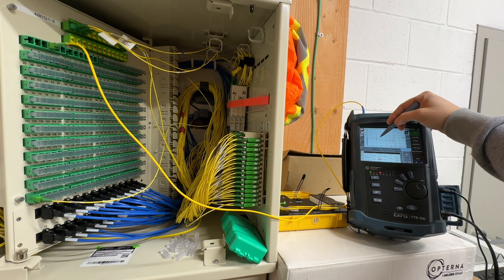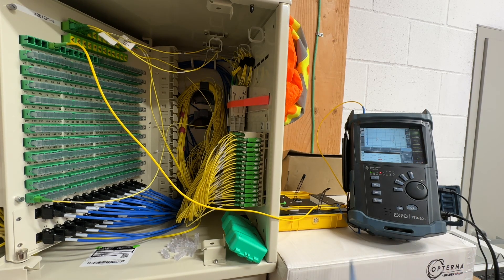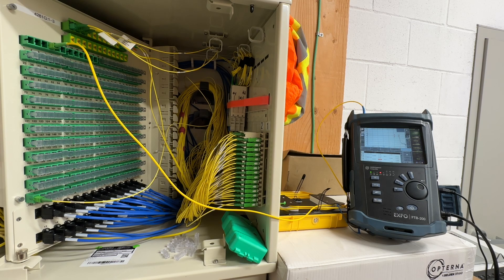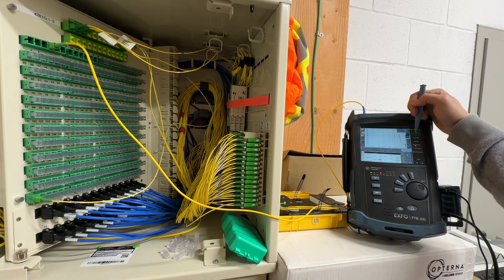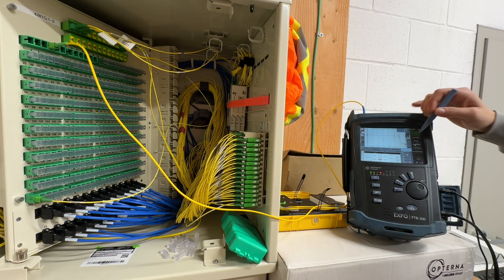Right here we've got a connector, a little bit of reflectance, very small amount, and a connector loss of 0.58 dB — which is a little bit high. It's passable, but we'll give it a clean and try to get it down. After cleaning and retesting multiple times, there's no change in the connector loss. We'll add a comment stating that — it'll either have to be looked into by the manufacturer or accounted for within the loss budget. Right-click, save, and on to the next.